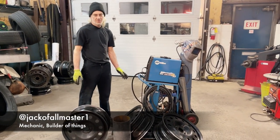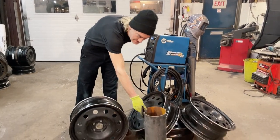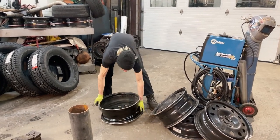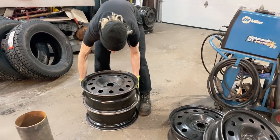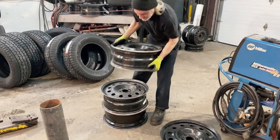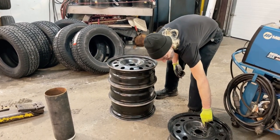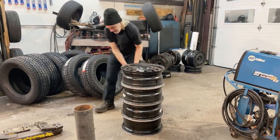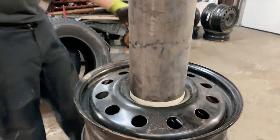We're going to make a wood stove out of recycled old steel wheels, an old sprinkler water main, some broken tools, and random bits and parts. One rim like this will be the bottom - we'll cut the center section out so it'll be basically just a cylinder. We'll do the same with a second one. On the third one, we'll leave the top, cutting only the center just large enough to match our chimney pipe, and it'll sit up on top like this. This pipe here has to be squared up slightly, then we'll set it up here.